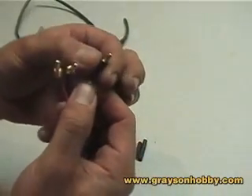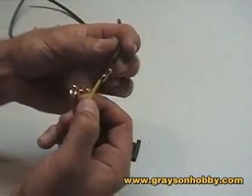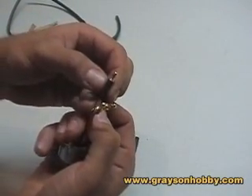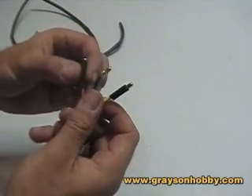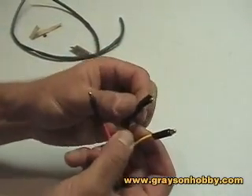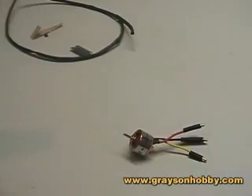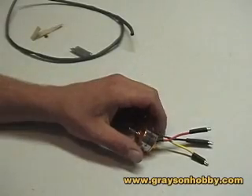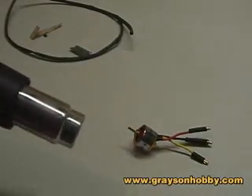Place your heat shrink over the bullet connector. I like to stop it just below the springs. Also, when you cut, make sure your cuts are square — if they're off, you'll definitely have some exposure. Keep the square side up; the bottom side can be off a little. I really recommend waiting for the wires and bullet connectors to cool down after soldering, because if you put the shrink on too quickly and it's not in perfect position, it will shrink prematurely and you'll have heat shrink halfway stuck on the wire — which means cutting it off and redoing it.